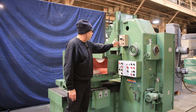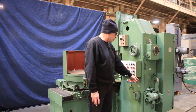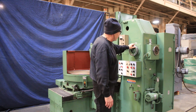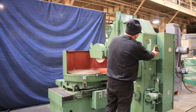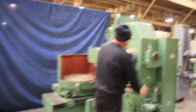Here is your chuck controller for your chuck operator's panel. The hydraulics on this machine are for your down-feed mechanism. You have your up and down here, synced along with this wheel. This is your in-feed dial where you'd actually make your settings for how many thousandths you want to take off.